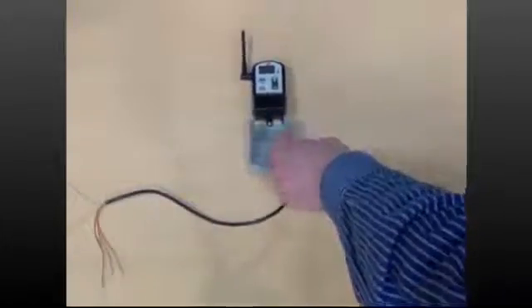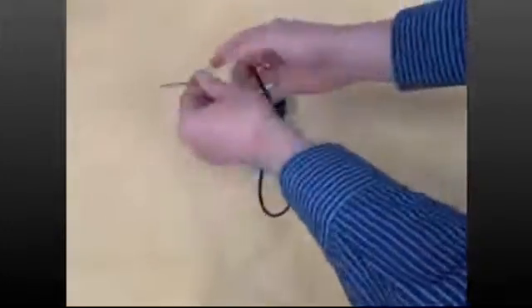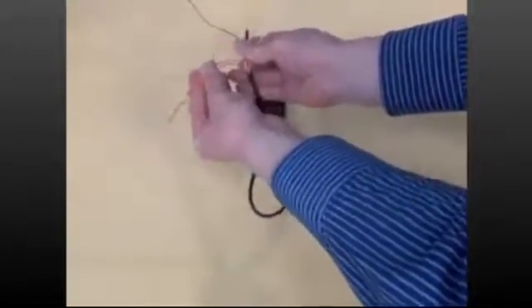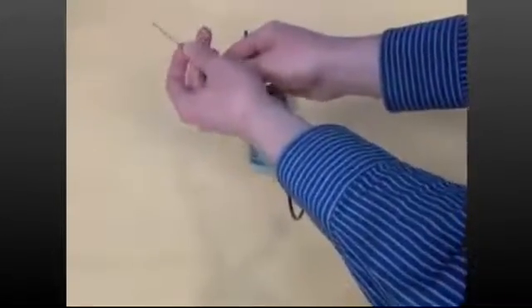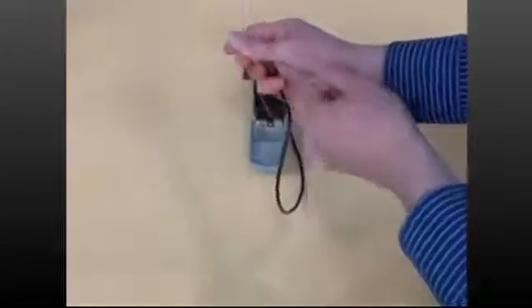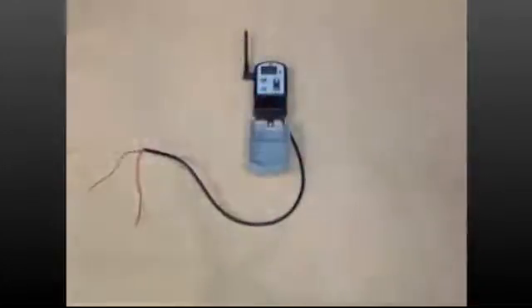Just a quick recap: the receiver has a total of five wires coming from it. Two red wires with no polarity that hook up to the irrigation controller's 24-volt terminal to get its power, and then a white and brown wire for plugging into a normally closed sensor port. You would use the yellow wire in place of the brown wire if you happen to have a normally open sensor port.